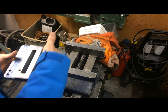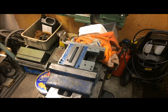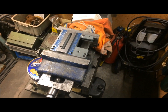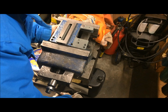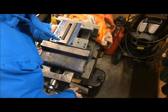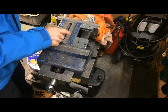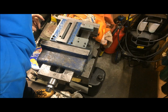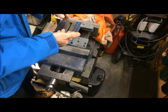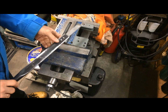While scraping, I had it here so that it was firmly tucked in. When you tuck it down like this, I mean, when you fasten it, the moment you clamp it, the forces that clamps will automatically, even at this point, flex a little bit down. So first I made the, I mean it's solid metal, so to speak, but I made a mistake of forgetting that it flexed a little bit, so I started scraping, of course, here, but also then testing it while here.